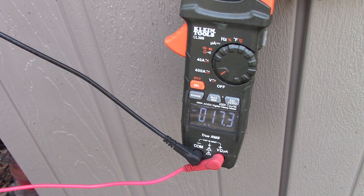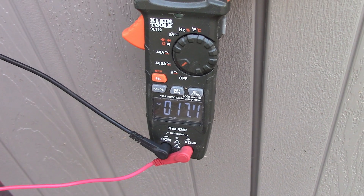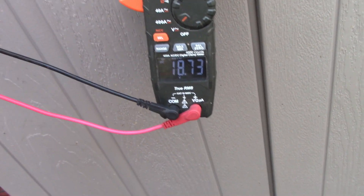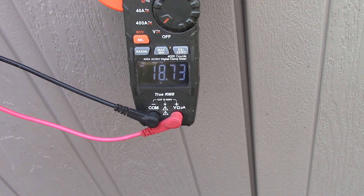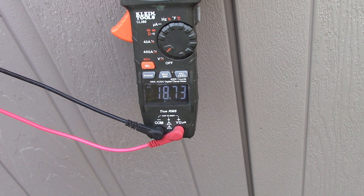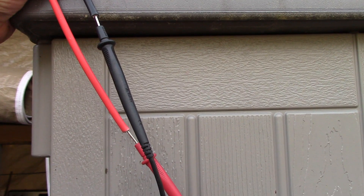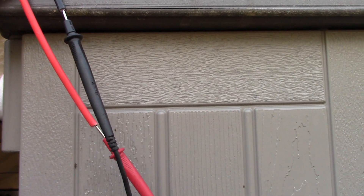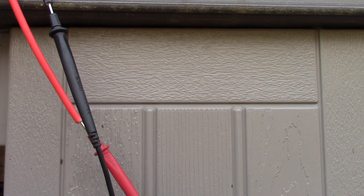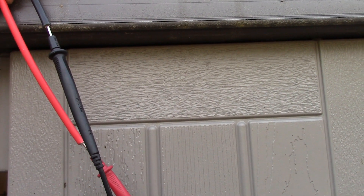I've plugged the wires into my panel. We know these wires are good and have good continuity, but check yourself every step of the way. It's getting a little late and the sun's going down, but we're still reading 18 volts — that's good. My wires are good. All I did was jab the ends of my meter into the wires to get a good connection. I'm going to join four panels and then four panels together and then run them off a higher feeder wire.